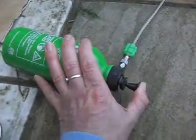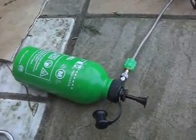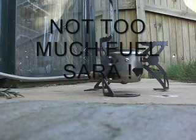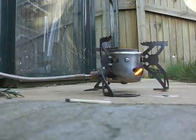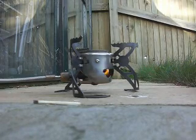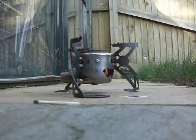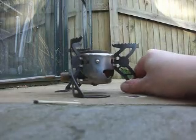It's got a little pump action here — it's necessary to pressurize the fuel before you use the stove. It's also necessary to allow a little bit of fuel to go through first for pre-ignition, to pre-heat the burner. As soon as that fuel is burnt off you can allow a bit more fuel in.